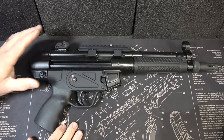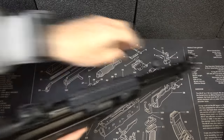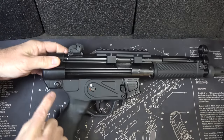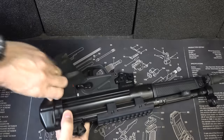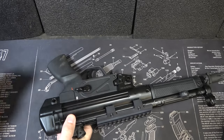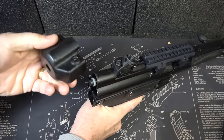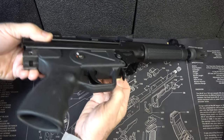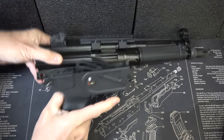Now we're going to field strip. I went ahead and took the SB Tactical Brace off to show you how to do it as it comes. First, pull the action back — the gun is unloaded, magazine's out. You'll notice there's a pin at the back and a pin here. Just push this through. These are not captive so they will come out — it's a good idea to have a couple of extras, by the way. Then we're going to pull our cap off — it just comes straight off. Push through the pin at the front, which is the shorter pin, then pull our action out.